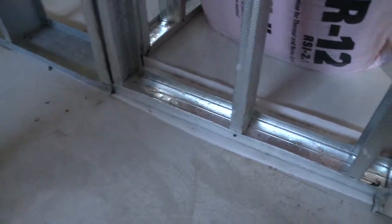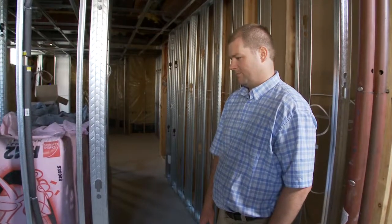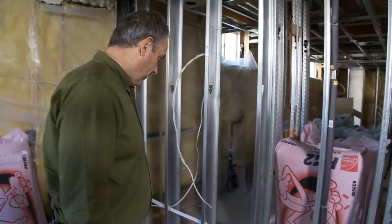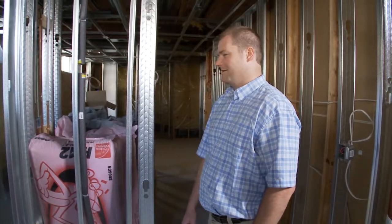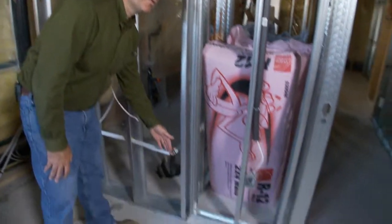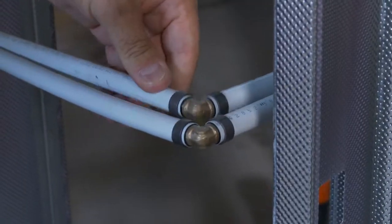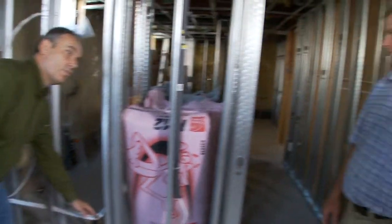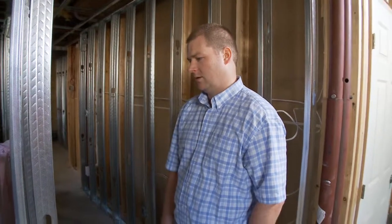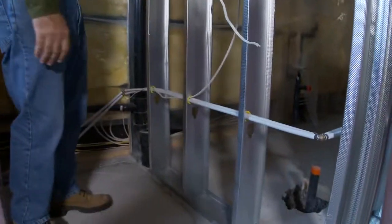It's worse than I thought. Did they actually do the plumbing, or who did this? The plumber did that, but I believe the contractor ripped that off the wall when he was upset. That's terrible — here it's sticking out past the surface of the drywall, which is unacceptable. These can't just be cut; they have to be properly crimped for the PEX to be properly passed into the corner. PEX line is perfect except at the corners — that's where it's weak. So we're obviously going to have to redo this; the lengths there are off.